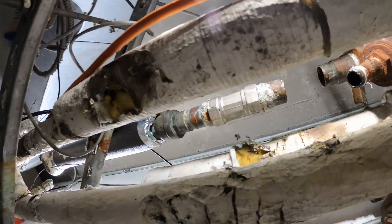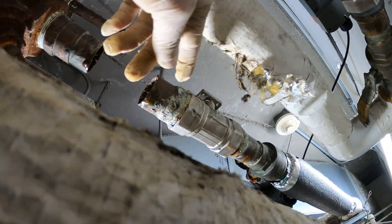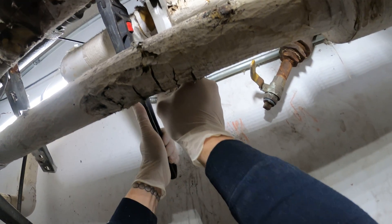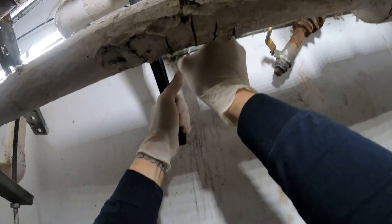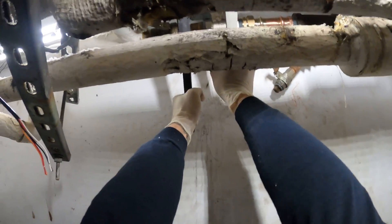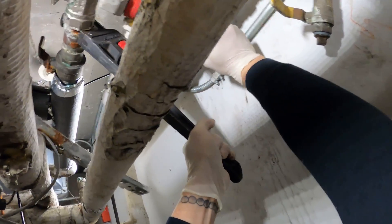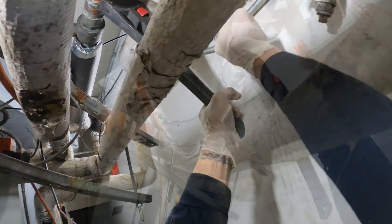Alright, let's cut this one off too so I can spin it off. Tough space to work in. So we got this cut now. The idea would be to spin off this valve, get that one on, and now we're gonna rebuild this. The only thing is to get some pipe wrenches in there — it's extremely difficult. I'm gonna need some Superman strength. Got it!